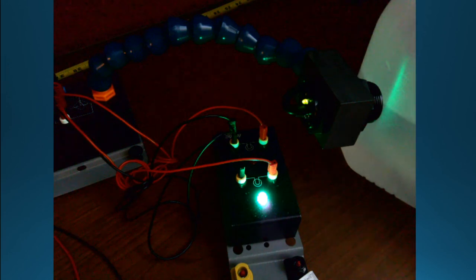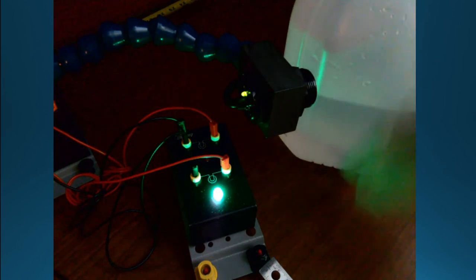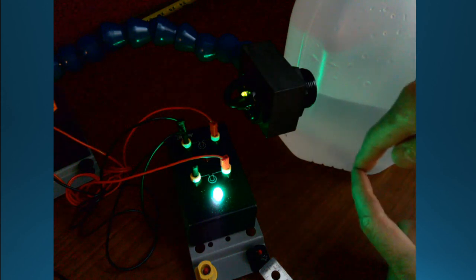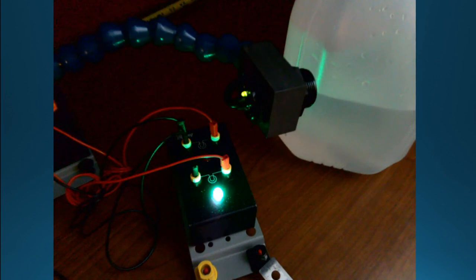Sometimes water will have other types of sensors in there. I think you'll see one in the process trainer here. If you take that class, what they actually have is a tube. And I don't exactly remember. Oh, yeah. If I remember right, it actually has a cylinder tube and then it has a rod that goes down the center, right? And so when the water comes up, it closes the circuit, and the higher the water, the lower the resistance because it has less metal to climb. And so that's another type of simple sensor.